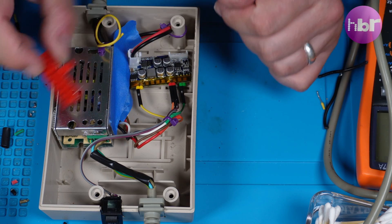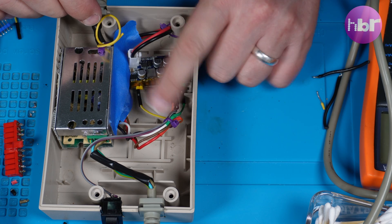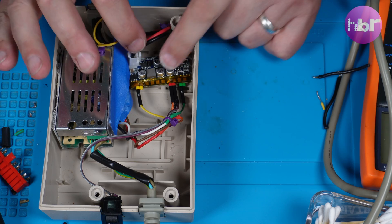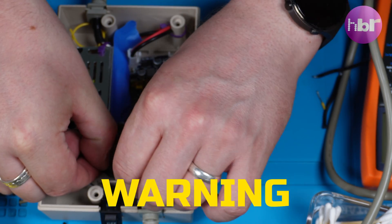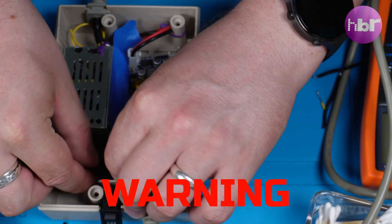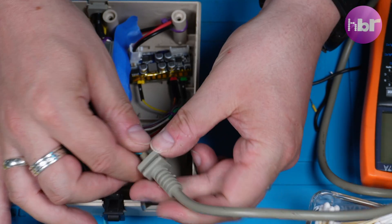What I've done here is desolder the entirety of that ATX connector, and I've added little pin headers — done in twos, just for stability, even when I only want to use one of the pins. That's based on the standard ATX pinout, and I need to pull out 12 volts, 5 volts, and minus 12 volts in order to power the Amiga — the same voltages identified in the previous video. We're just shortening the adapter to go directly to the ATX board. And it's important to remember when playing with mains voltages: don't do it. If you don't know what you're doing, don't touch the mains. It hurts — I speak from experience, and that's another story.